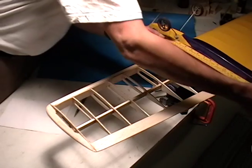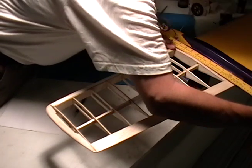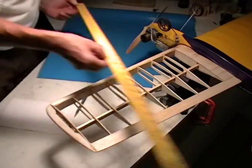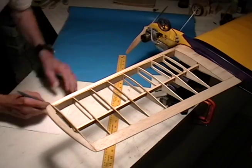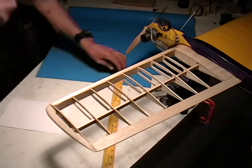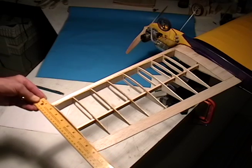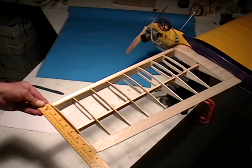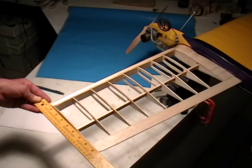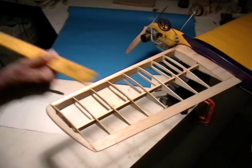The next step is the wing root. I take that measurement and allow for roughly about an inch and a half overhang of material — this allows me material to grip while I make the adhesion to the wing. Lastly I go to the wing tip, where the same thing applies: I allow about an inch and a half at the wing tip area and transfer that measurement to a piece of paper.